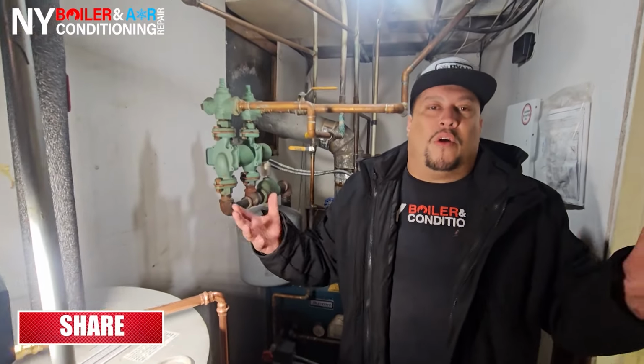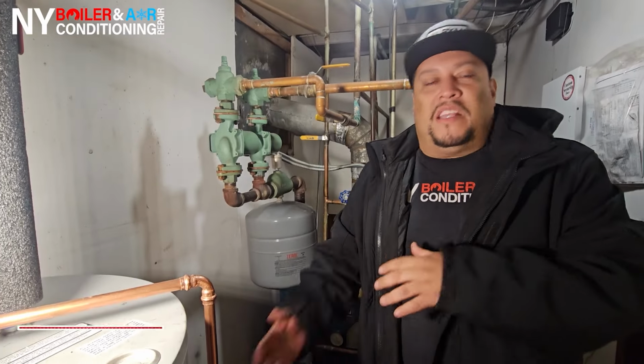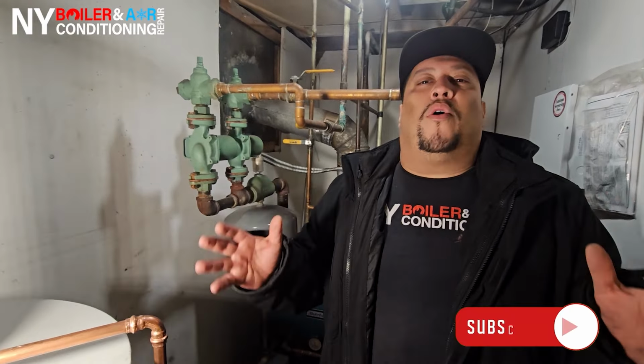So guys, carbonization could be numerous things. What causes it? Usually it's lack of air. In this case, it wasn't an issue. It also could be a bad nozzle, okay? That does happen. Remember, the nozzle is this small and the pinhole is really, really small. If your oil tank is not clean or it's full of sludge, or just a little something small gets inside the little pinhole, guess what? It changes the characteristics of the fire. And guess what? It's going to be smoke. You have a smoky fire, you will carbonize the boiler in due time.